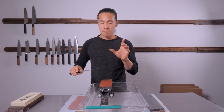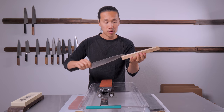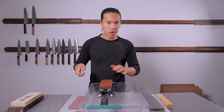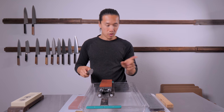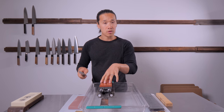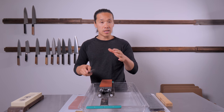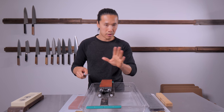A lot of folks will stop here, grab a piece of wood, and pull the cutting edge on the wood to remove the burr. That's fine, there's nothing wrong with that. I prefer a different method — I go back to the stone and do what I call a counting-down method. I count down from ten strokes on each side, down to eight, six, four, two, and then one stroke. I'll do it now so you can see exactly what I mean.